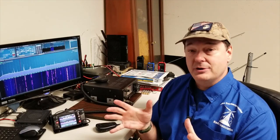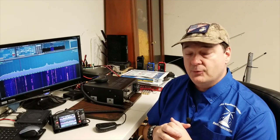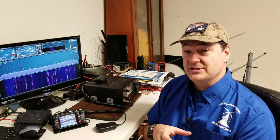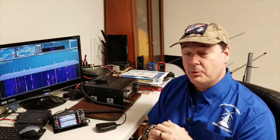It's really cool that we've got that capability. On 70 centimeters I'm going to be almost predominantly digital, and on 2 meters predominantly analog, because most of our members have analog radios. But we're trying to drum up support for the Fusion C4FM digital on these new repeaters. Now we have two repeaters — same model, one for 2 meters and one for 70 centimeters — and two new Comet GP3 antennas for both those frequencies, back at the repeater site up on that tower.